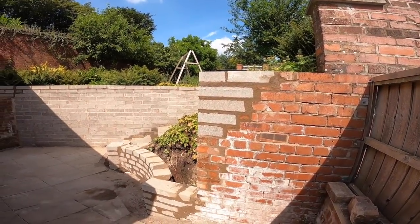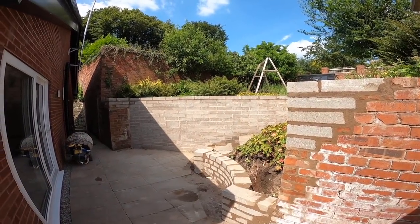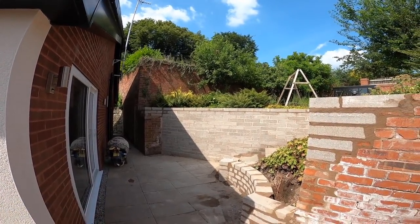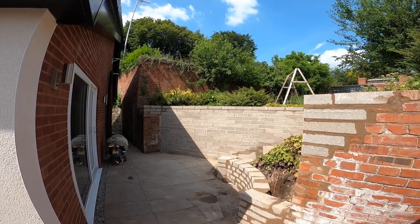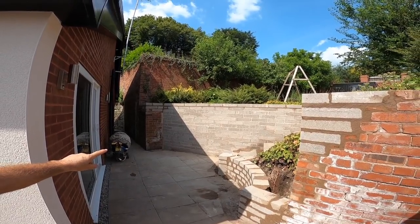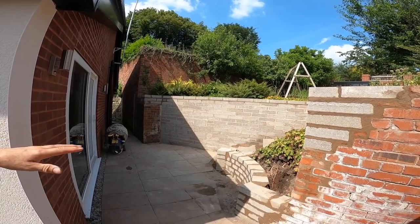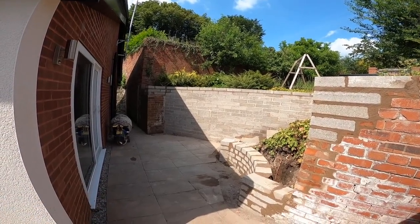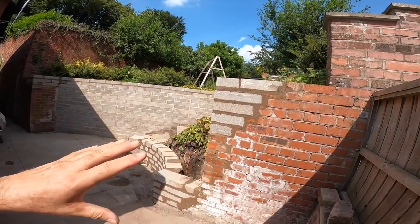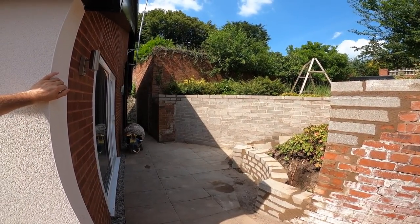Yeah. And I've said once they're done, they're going to pile the bottom few feet with smash flags and stone for drainage. We can't put a drain in because there are no drains, so it's going to be a drain itself. And once it's rendered, I've said nice big holes drilled below the render line for drainage, because we're not sure where the flags are going to end, the heights. So that wall's safe again now. That wall's safe, that wall's seat friendly, and that wall's keeping all the mud back eventually.